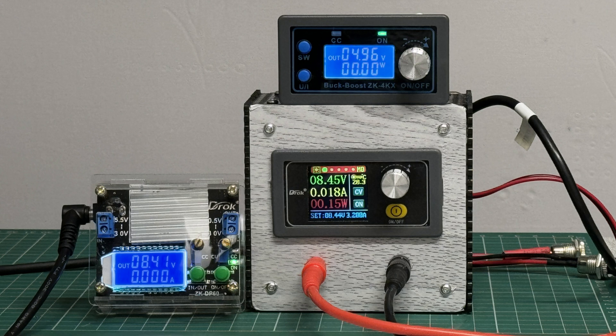In the next video I'm going to look at some power supply modules you can use to make your own desktop power supply. These pre-built modules are easy to wire — just put them in a small enclosure and you can use them for charging lithium-ion batteries, camera batteries, nickel-metal hydride batteries, car batteries, whatever you need. I'll show you how to set up constant current and constant voltage with these devices. I'm already using one in my multi-purpose lithium-ion battery charger, consolidating about 27 different camera chargers into one supply with adapter plates for 4V or 8.4V.